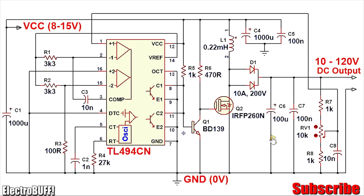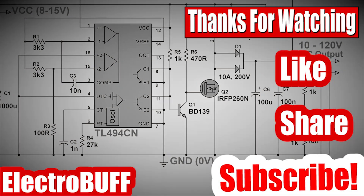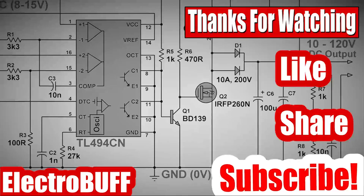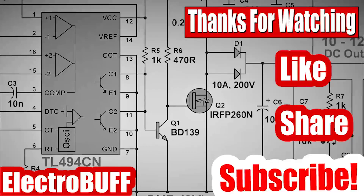In this case the circuit will work just fine as shown, because the IC has a maximum duty cycle of 97%, so the MOSFET Q2 will never be completely stuck on. I hope you enjoyed this video — if so, make sure to give it a like, share with your friends, and subscribe to my channel. See you in the next video.